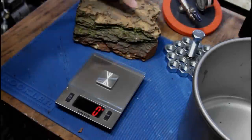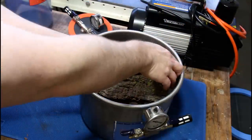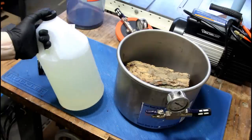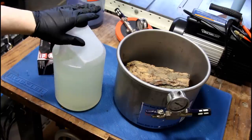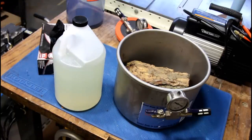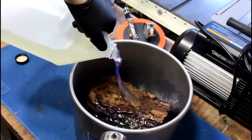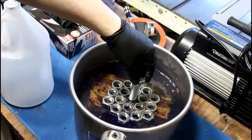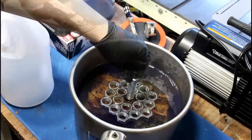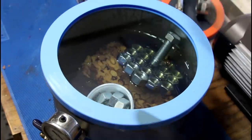I was curious to see how much it weighed before we got started — it's 738 grams. It just barely fits in there after trimming. This is stabilizing resin — it's a little different than casting resin. Stabilizing resin is used to make soft or punky wood more solid; it basically gives it rigidity. The nice thing about stabilizing resin is you can use it over and over again. We need to completely cover this block with resin. Let's put the lid on and hook up the vacuum.